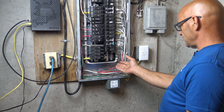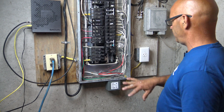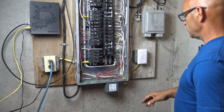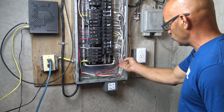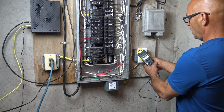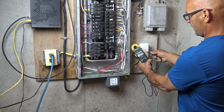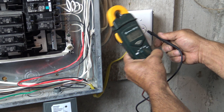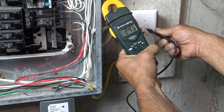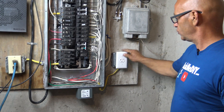I wouldn't turn the panel on without putting the cover on, but I have to show you what I'm doing. I'd rather leave extra wire than not. Let's go ahead and turn the breaker on — no sparks, no fire. Our wire is now hot, with 120 volts running to each side of our outlet. Let's check the outlet: from hot to ground, 124 volts; from the other hot to ground, 124 volts; and going to each hot together — 245 volts. That's exactly what we're looking for.